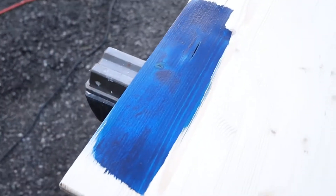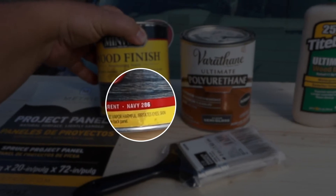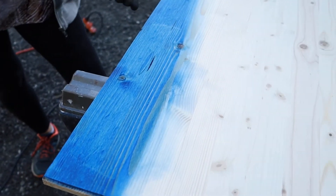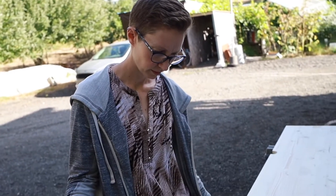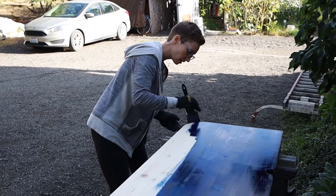At first glance, the stain looks very blue — the light doesn't even do it justice. Toweling it off, it's supposed to look gray. It's very important that you read the container before you buy a stain. I was going for a grayish color, but if you look right below on the label it said 'navy' — and that's navy blue. Since we tested it on the underside first, he has the choice to change the color. He's decided he likes the blue, so we're going with navy. It's a nice color contrast and will make an accent piece in the room. We're going to do a semi-gloss finish over the top, so it'll shine a little more. It's going to definitely be something people will talk about when they walk into the trailer.